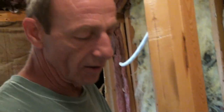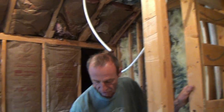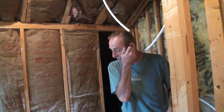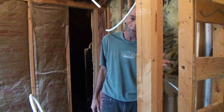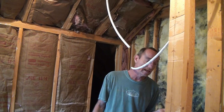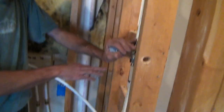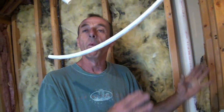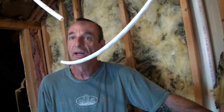This shower nowadays, when you are changing your shower faucet out, make sure you buy what's called a scald-proof shower faucet. Posi-Temp. Posi-Temp, scald-proof. Yep. In the majority of the places right now, that's almost code anymore. And what that does is, if you're in the shower and somebody flushes the commode out there, the water pressure will change, but the temperature of the water will not change. We've all had that happen to us.